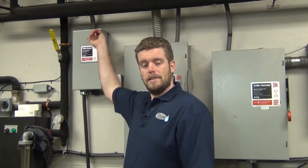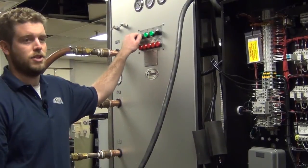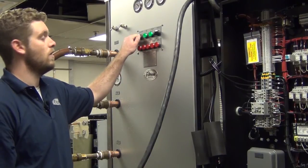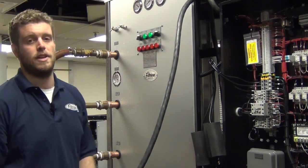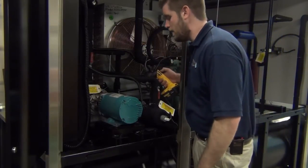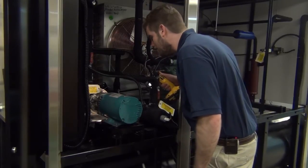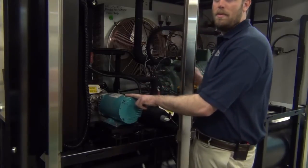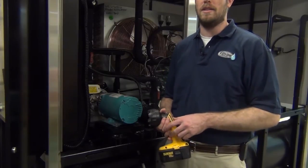Now that the refrigeration system is all opened up, go ahead and turn on the main power disconnect. Now we're going to go over to the pump and make sure that the phase is correct. Once the main power's on, you've got to trip the breaker for the pump. To turn the pump on and check the rotation, the switch on the top left is the manual on-off. Bump that on and off, and you or an assistant can check the rotation of the pump using a flashlight, making sure that it's matching the arrow on the pump housing. If it's not, then the phasing is incorrect and you'll need to switch two of the three legs on the main power supply.